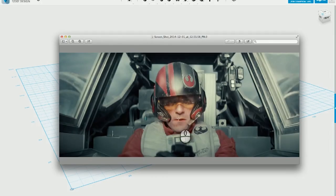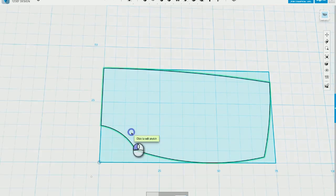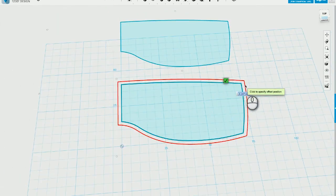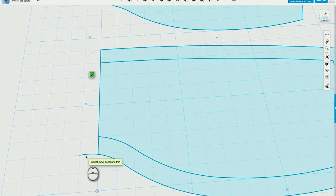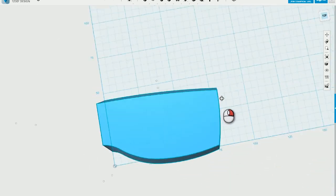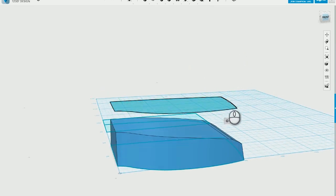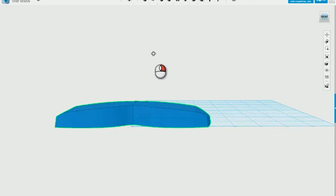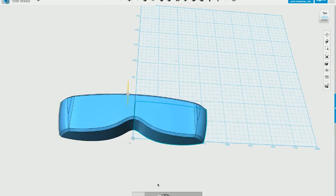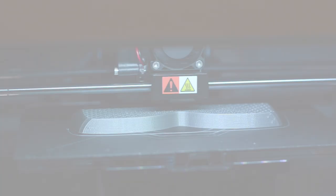Here's the quick rundown. First, I scaled the visor so that it was small enough to fit inside my vacuum forming area with a little bit of space around it so that the frame could fit over it. Then I drew the profile shape of half of the visor and duplicated that shape, flaring it out a bit at the bottom so the vacuum forming buck would be tapered to make it easier to pull the plastic off. Then I created a loft between those two shapes, creating the main bulk of the visor body. Then I added a curve to the surface, mirrored it so I had a full visor, and softened a whole bunch of the edges with chamfers and fillets. The piece got printed on our Dremel Idea Builder at the medium settings and it took a couple of hours.